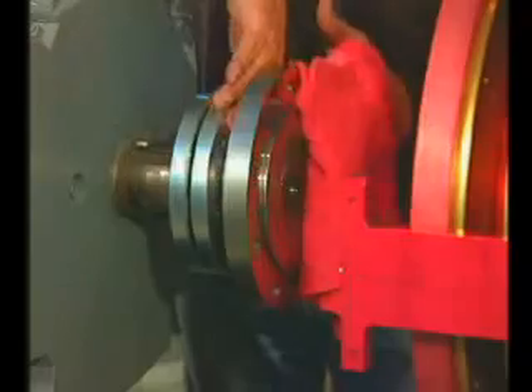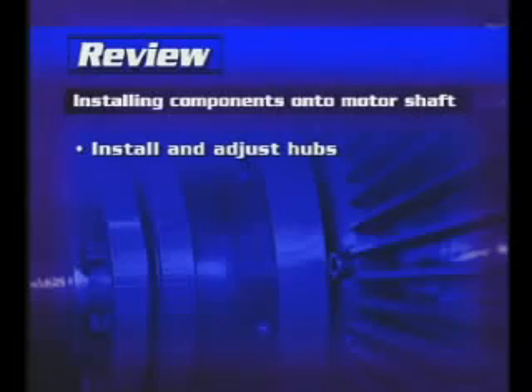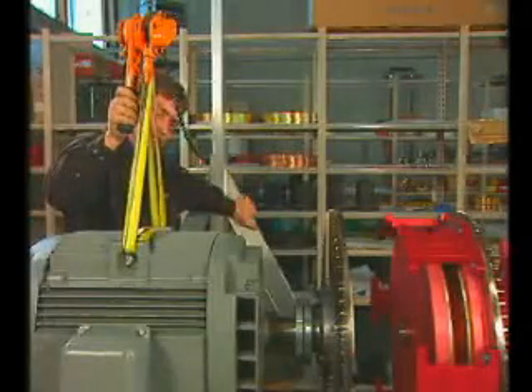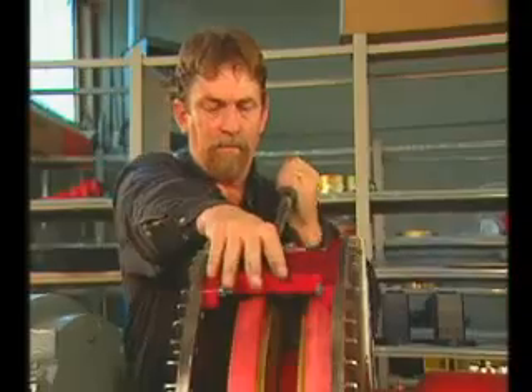Inspect and clean mating surfaces before installing. Install the motor side conductor half onto the motor hub with the hub flange bolts and thread-locking compound. Tighten to the specified torque using a criss-cross pattern. Using the proper lifting gear, bring the motor into a position away from the magnet rotor, yet close enough to install the motor feet bolts. Align the conductor match marks for reconnecting the conductor halves. The load side conductor may need its position adjusted to line up horizontally. Move the motor using the jack screws to mate the motor side conductor with the match-marked air gap spacers. Install the air gap spacer hardware with thread-locking compound and torque to specification.